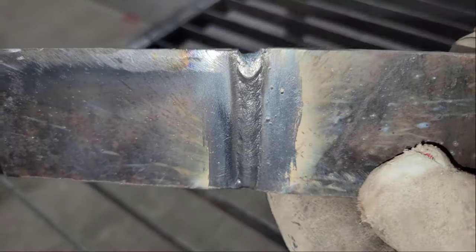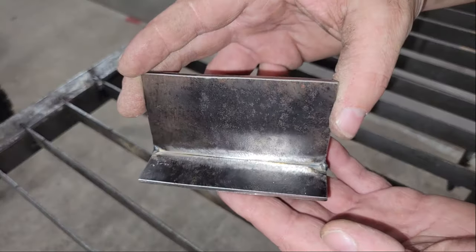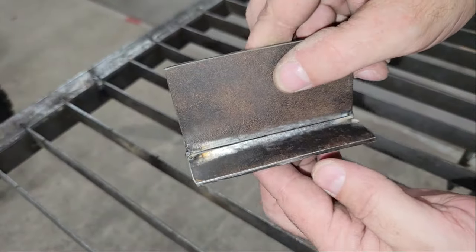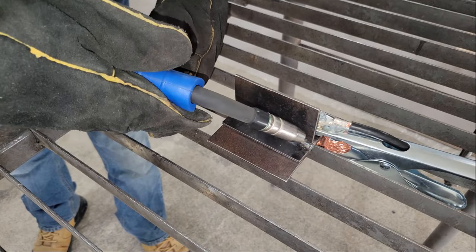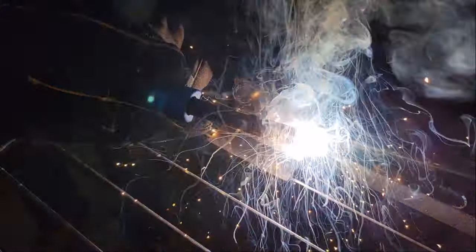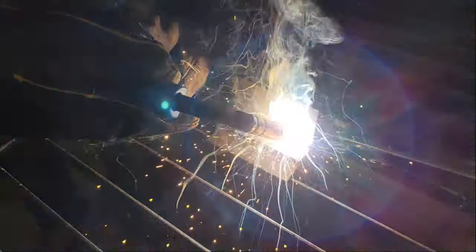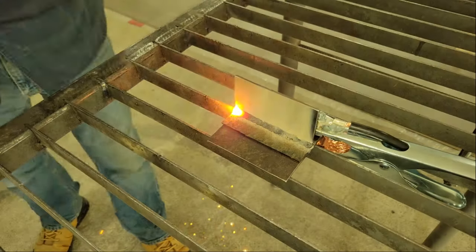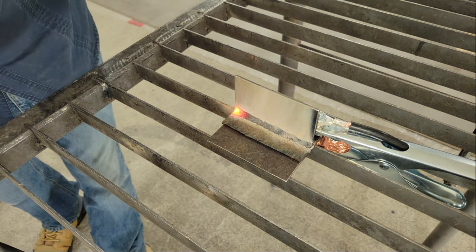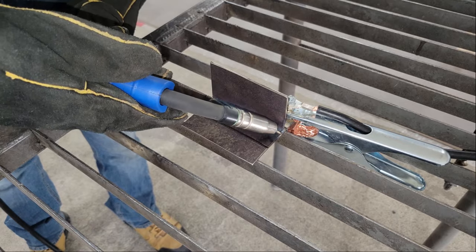If you're new to welding, you're probably wondering what all the mess is about. Flux core is really easy to learn how to weld with and it works great outdoors because you don't need gas or any wind blocks to shield it, but it's a lot messier than MIG and TIG because the flux burns and creates a lot of smoke and residue, and any contaminants on or in the metal will produce spatter — those little balls that you see stuck to the surface around the weld, which need to be cleaned up with a wire wheel. Grinding the weld area to bare metal, cleaning off any oils, and using anti-spatter spray can help limit the mess, so you do need to keep a few extra tools on hand and have good ventilation to clear the smoke out when you're using this method.